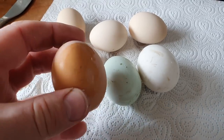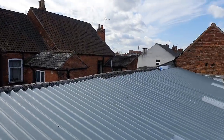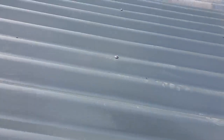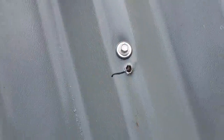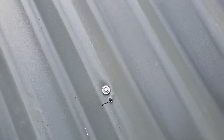Back on the roof again today — a little bit more work, mainly getting the screws in, and they're lining up now. Look, I found my purlins. One thing that really does my head in though is that sometimes, very occasionally, you'll put a screw through and you'll hit the old screw underneath. You can see it in there — so I've had to move upwards and we're gonna have to seal this section up. Can't be helped — obviously you can't tell what's under there before you start to make a hole.